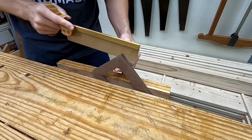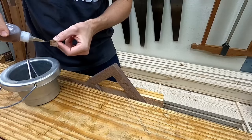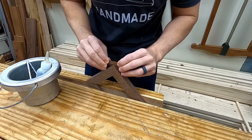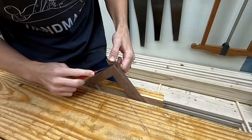For some reason it didn't occur to me to actually follow through and insert a spline, so here's a clip from a previous video of mine doing exactly that — sawing a kerf, sawing some splines, gluing into place, cutting that off with a knife, breaking it off, and then planing it up to clean it up.